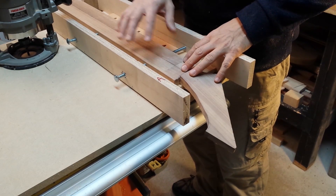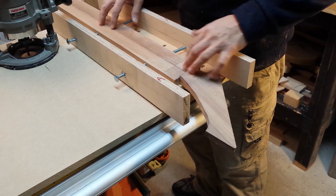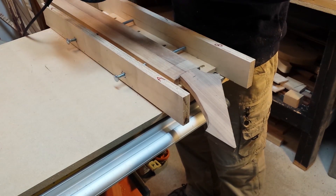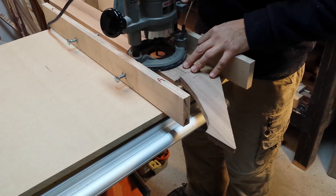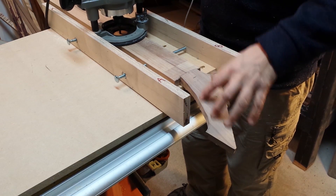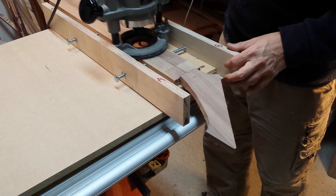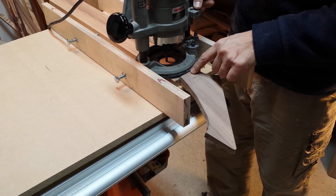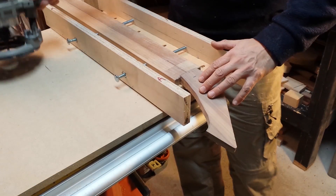After a lot of fine-tuning, the headstock is properly in place and is stable — I basically used the router bit to align the neck. Now as I mentioned previously, this neck has a headstock veneer. So as the router is riding on the neck, when it reaches the headstock veneer, it's going to bump into it. So I can't use this jig as-is with this neck.